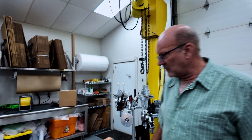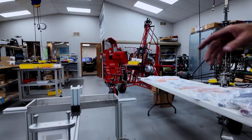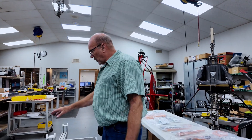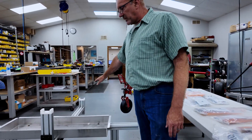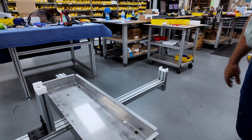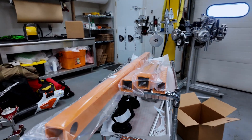Next, it's time to get started on the frame sub-assembly. So we're going to start with the base of the kit — all the two-inch square tubes. We have a little assembly stand behind us. I have several of these and I loan them out to builders if you're building at home — no charge, I'll send it to you and just get it back whenever. It has a seven-inch offset from the tail boom up to the keel tube, which elevates the whole machine up so the first assembly steps are a lot easier and you're not crawling around on the ground. Since our parts are all powder coated, we do have to ream out the powder coating from the holes first, and then we can start putting them together.